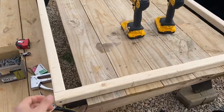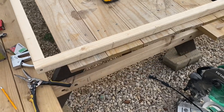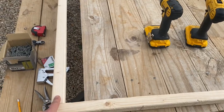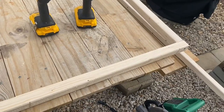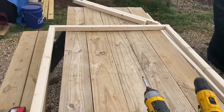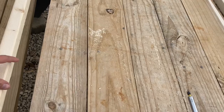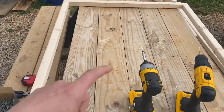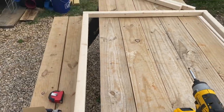Close up. I use these 2x2 furring strips, which are actually about 1.5 by 1.5. And I just do usually 48 inches tall for the midsection, then tops and bottoms, I add whatever the width is. Then I'll add these 2 braces in the middle. And then I'll put my 2 foot hardware cloth on each section in the middle, and also the hinges on one side, and then I'll attach them to the posts.